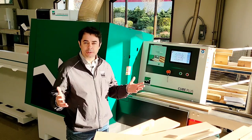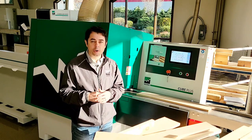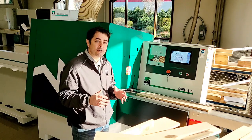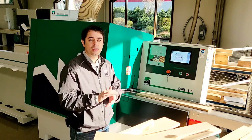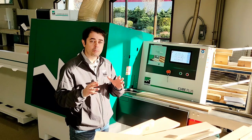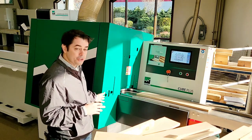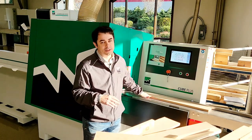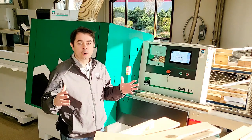Now, I know what you're probably saying — all the spindles are mobile, right? They all move based on the values that the operator puts in the controller, and that's correct. But this feature now moves the left spindle depending on the width of the piece automatically. It does this because the mobile spindle feature outfits the machine with a photo eye on the side, which measures your workpiece while it's on the infeed table and sets the spindle to the appropriate position.